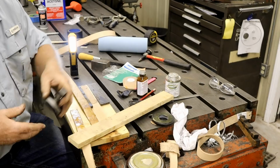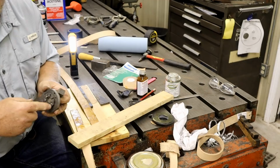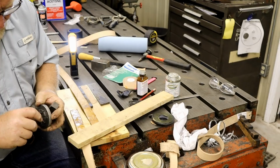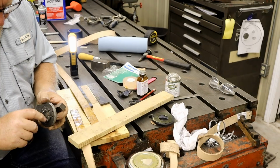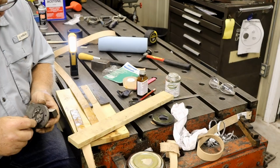I'm really worried about screwing this up more than it is. So my plan, I've already cleaned all the paint and everything off this with acetone, is I bought some A2 filler rod for TIG. It's a hardened steel rod. And I'm just going to try to make a little tack right there and build this edge up. And then put it on the surface grinder and grind this part flat again. And then take a little die grinder and go in and try to shape that wall.